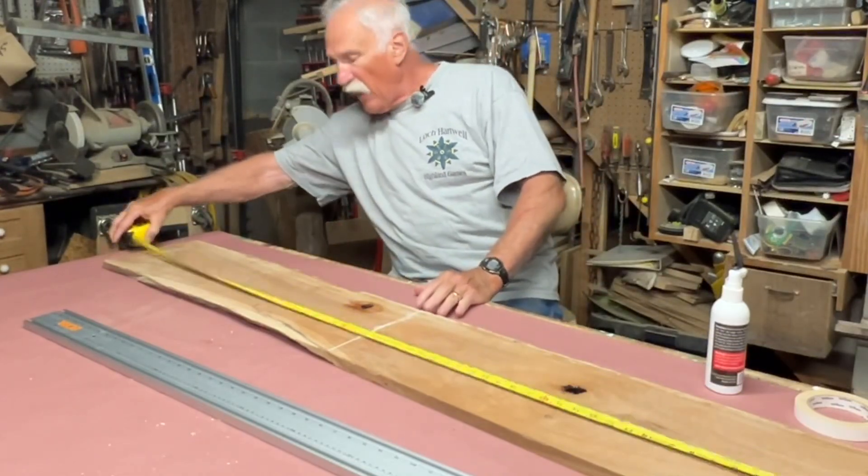I'm not going to stain this or color these in. I'm going to use polyurethane — I don't think I'm going to paint these, but I think the polyurethane will darken the carved areas. I'm not going to sand inside the grooves, so I think the polyurethane will catch there and make it a lot darker. I want a clean corner, so after I get all these cut out I'll sand over the corner or use my block plane. This is not the best piece of wood — it's got some water damage, it's starting to rot in spots — but it's kind of rustic looking, and I think the added hand carving will keep that rustic look going.